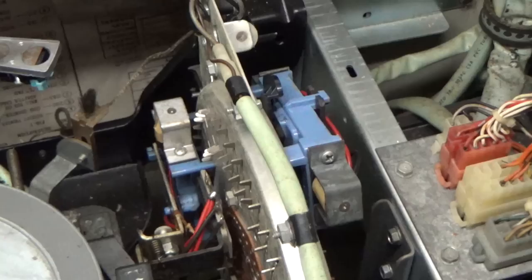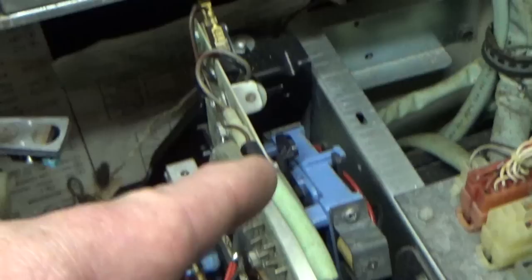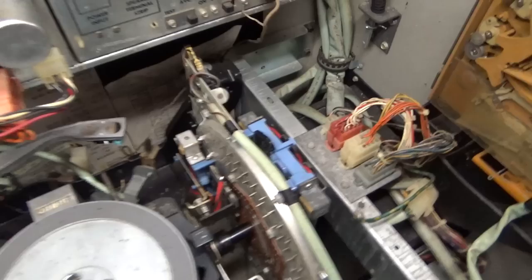So I'm going to turn it back to scan, and what happens after you write in a selection, now remember we put two in, it can store them because it just knocks over the levers physically. So this one's over and one down there is over. So now that those are in, this switch is on, so this side has power. Okay, so I've got it in off right now so it can't move, but whenever I put it to operate, okay, so it turned around and look where it stopped. It stopped where that little lever is pushed over.